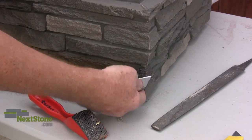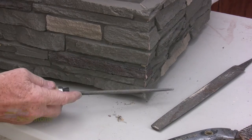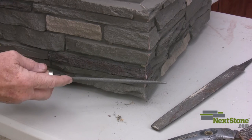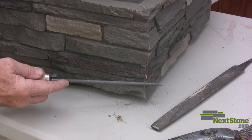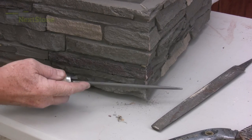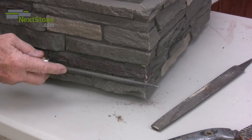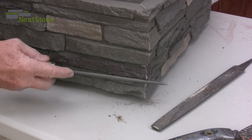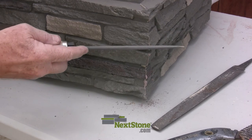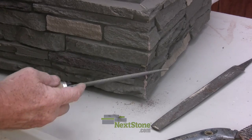We find the best result is obtained by cutting the longer side down to meet the shorter side, rather than filing or cutting both sides down at the same time. Cutting the longer side down to meet the shorter side will minimize the appearance of a straight seam running down the length of the joint at the corner. We'll demonstrate the rasping of the panels further on with some other panels that show much more overlap.